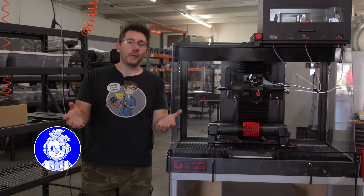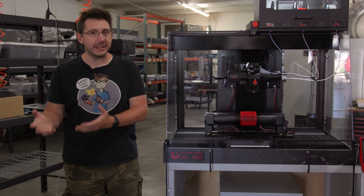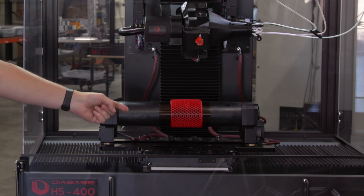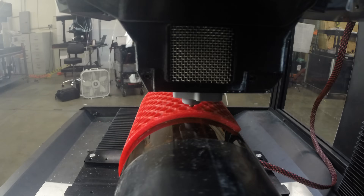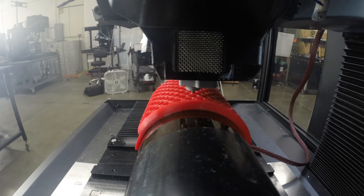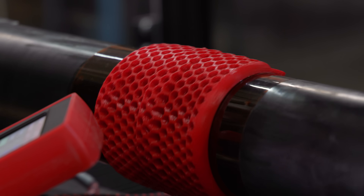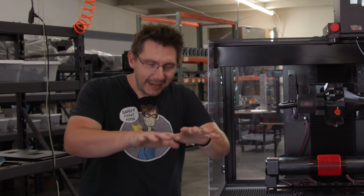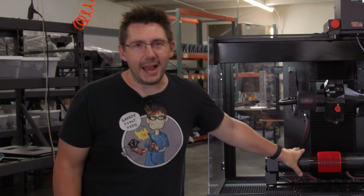This material here is flexible for comfort and it all built on the same build plate, and it looks fantastic. The H5-400 is a CNC machine that can 3D print, which means we can bring over CNC technologies to additive manufacturing like fourth and fifth axis. We're utilizing our fourth axis for rotary 3D printing. It's printed using the rotary axis, which gives it cylindrical layers, and cylindrical layers are going to give it more strength than if it were to be printed on a flat bed. Try to print this on a flat plate — you're not going to be able to do it efficiently. You're either going to use more material or you're going to have to print it in a way where the strength isn't there. Can you imagine printing it flat and then having to heat form it around a tube? It just doesn't make sense. It makes way more sense to print a part that needs a cylindrical shape on a cylindrical axis like this.